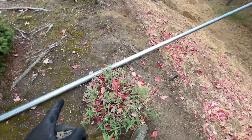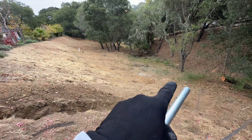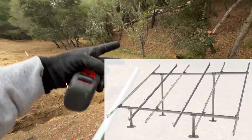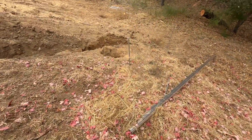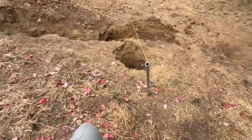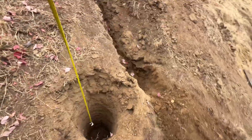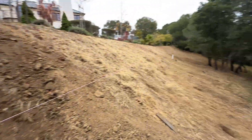Here are our pipes, which are going to be in the ground supports for the panels. There will be horizontal runs, and on top of these horizontal runs rails are going to be attached. Our plans call for going three feet eight inches into the ground — almost four feet — then a horizontal line for the entire array.